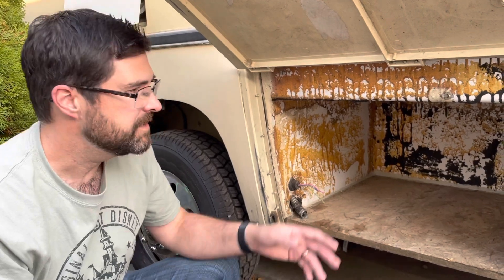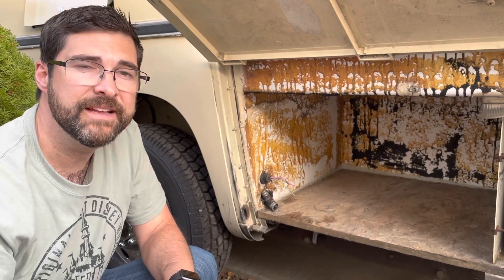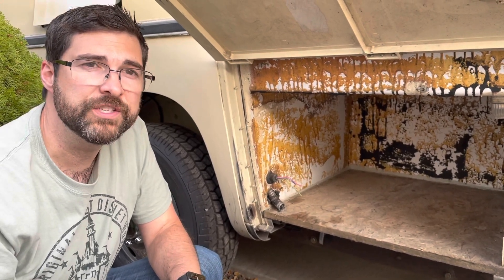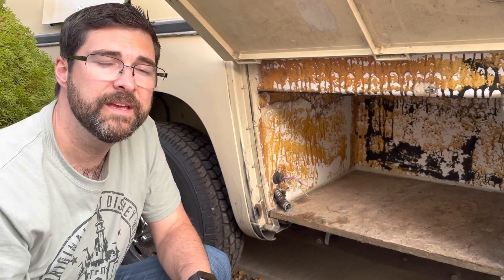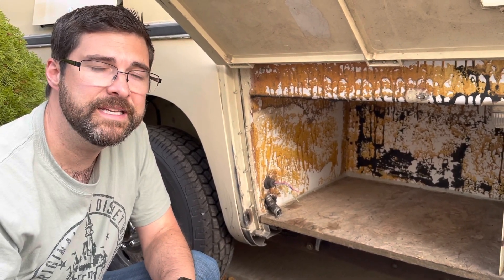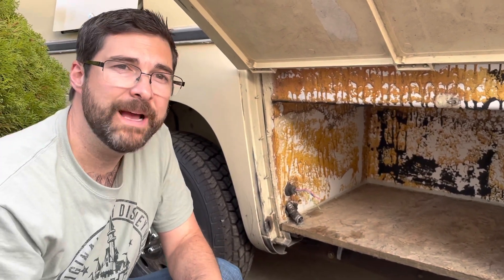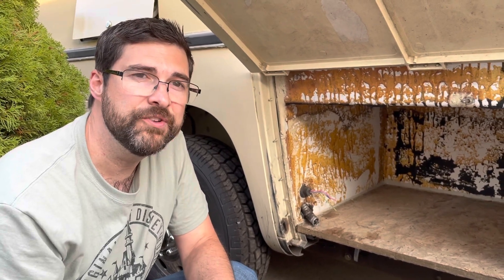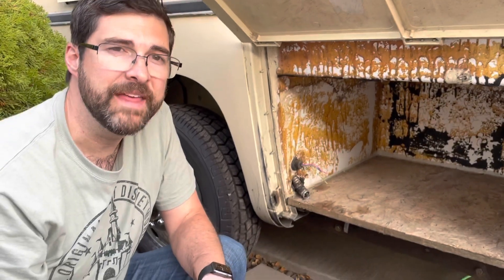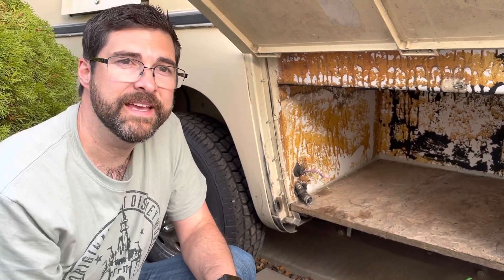As far as next steps go, we've got to tear this out and get ready to install the new parts. We'll also do cleanup on the parts we got and start doing some of the repairs on the generator. From a charging standpoint, I'm hoping there's a small part inside the generator called a rectifier, or bridge rectifier, that provides DC electricity to the field winding. If that fails, the generator won't generate. So I'm optimistic that might be the only electrical problem. We have a new rectifier and we'll install that once some of the mechanical tune-up work is done. We'll keep you posted as we make progress.